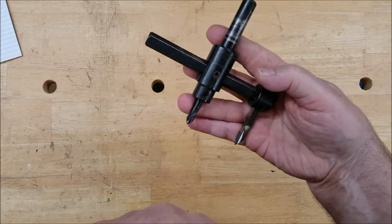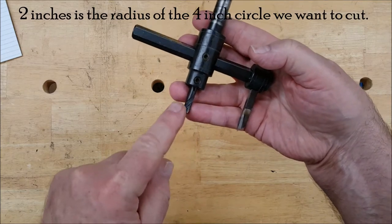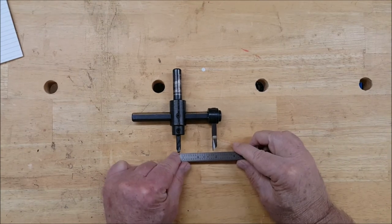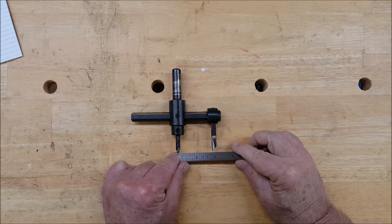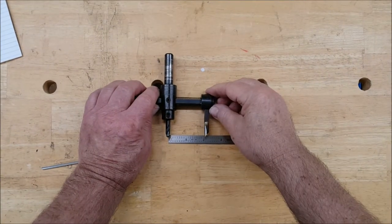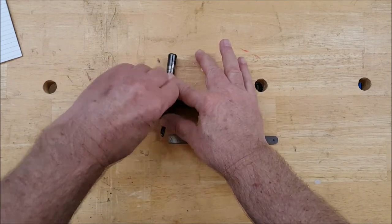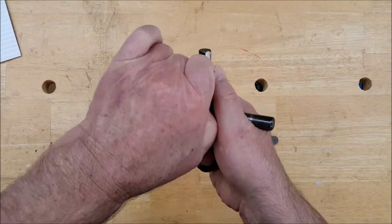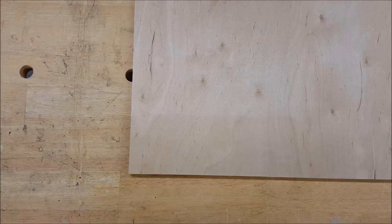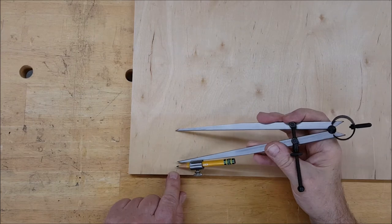And now we want to make sure that we've got 2 inches from here to the center point on the drill bit. We've got to move about 1/8 of an inch. And because we're not going for really meticulous work, we'll accept eyeballing it on the 2. Now let's mark off where the circles are going to be. Allow a little room for waste over here